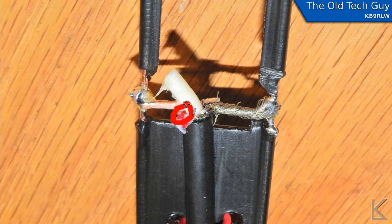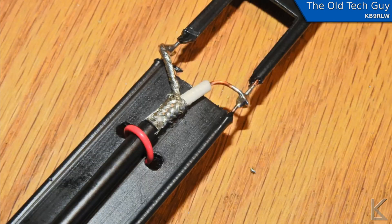What you want to do is strip back the coax a little further and do it so the wire is coming straight up out of the coax. That way when you do your soldering you're not going to melt the insulation. You want to tap both the shield and the center at the same distance up the antenna. To tune the antenna after you hang it up and check the SWR, you reheat those solder points and move them slightly in one direction or the other — move the center and shield together so they're at the same point across.